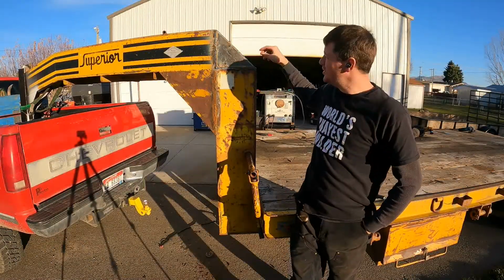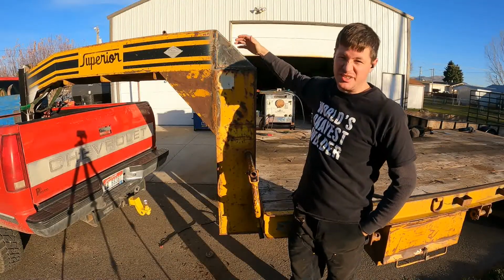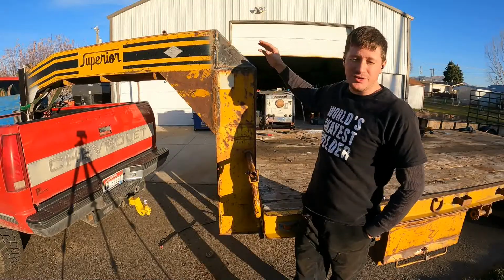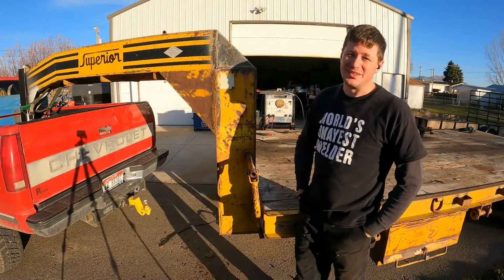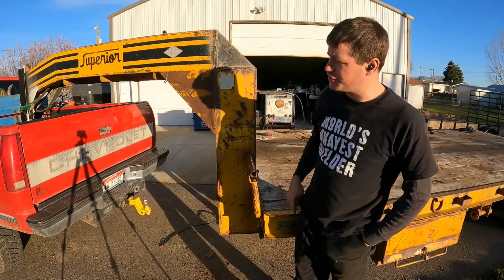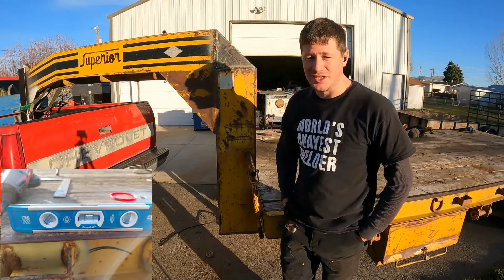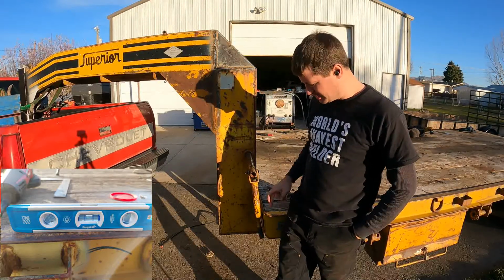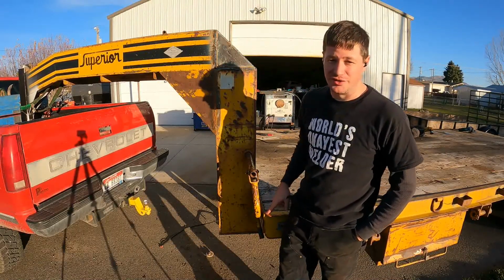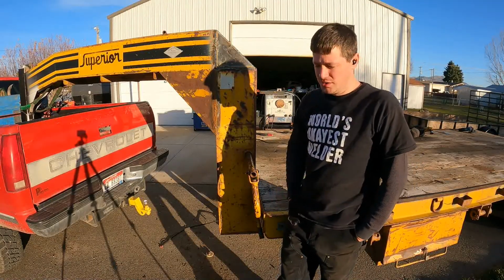Okay, all the gussets are welded in, the crossbar. I don't know what you want to call these gusset braces. They kind of close it off more cosmetically than structurally. But that's all done. I've got the trailer on my pickup truck, and with the level on the deck unloaded, it's about 1.5 inches high on the front, which is perfect because once you put a load on it, it should sit about perfectly level to run down the road.